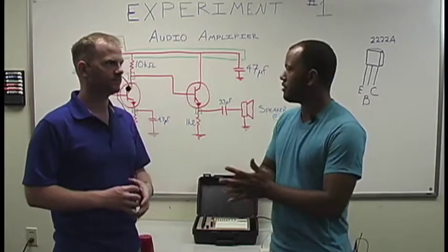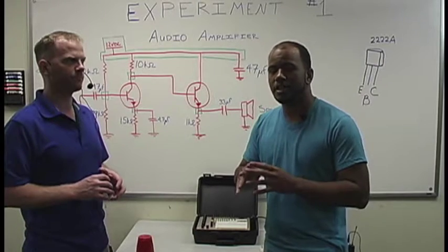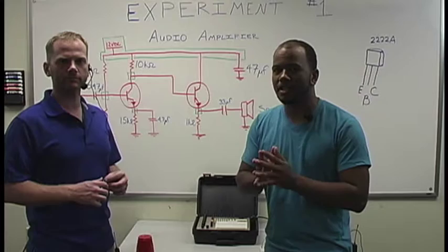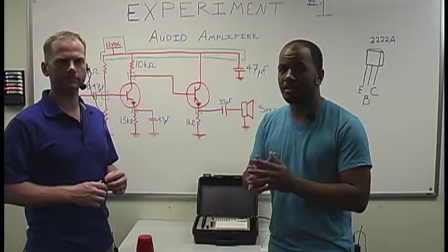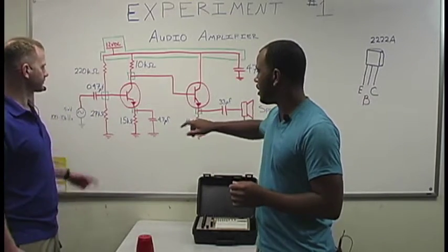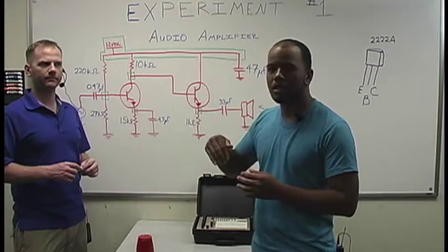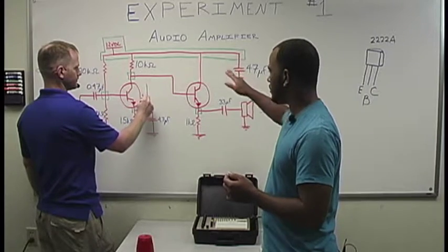Right. So the key word for BJT, or bipolar junction transistor, is biasing. Simply put, it's 2 things really. It's electrons, which I'm sure you guys learn in science, the particles with a negative charge, right? And holes, where electrons aren't. As you can see here, we have arrows drawn going down out of the BJT component. That's signaling our current flow direction. So it's really electrons and holes passing through the BJT.